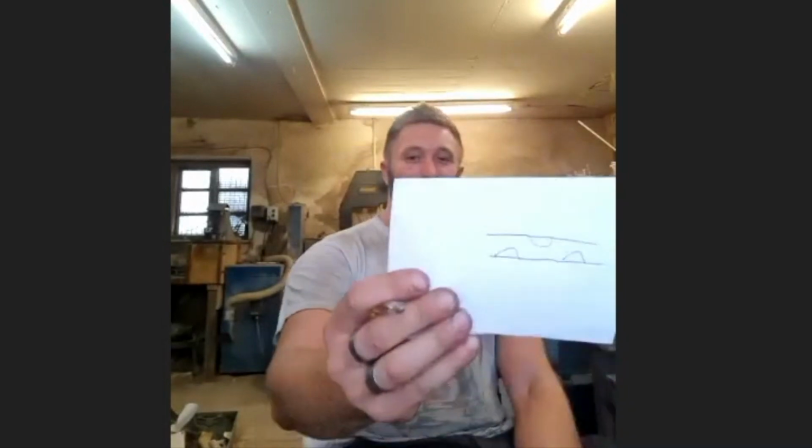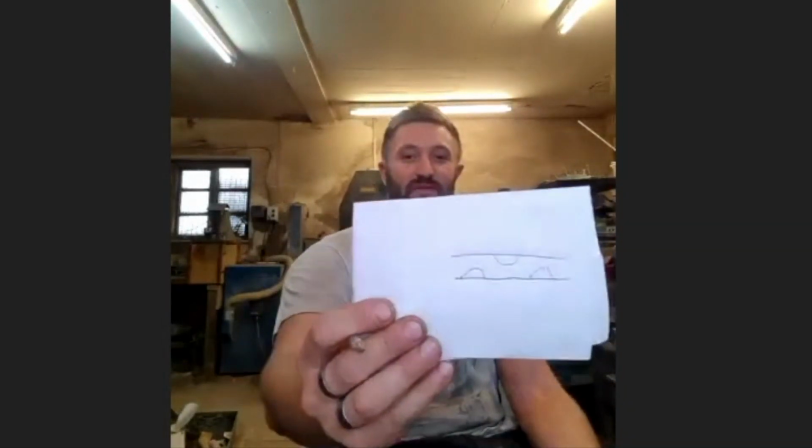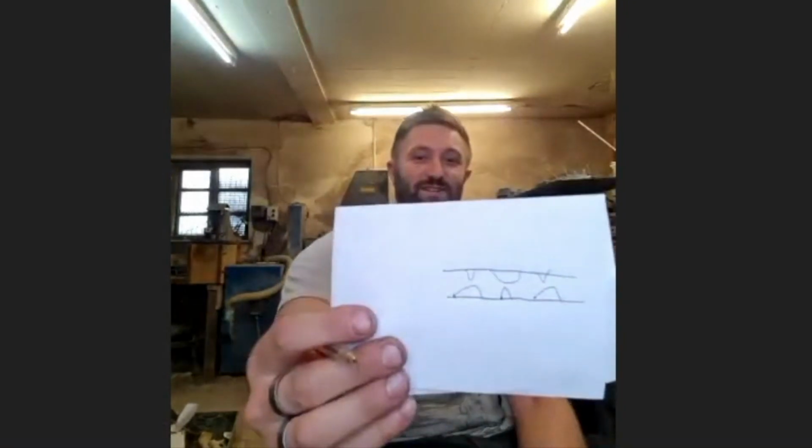As if that's your spring. And then you would draw in your first file cut, which would be a round file, and you suddenly get this wavy pattern. And then if you want to add something spiky to it, you add some spiky stuff because that's a triangle file. Before you know it, you've got yourself a new pattern or a slightly different pattern, whatever it is.